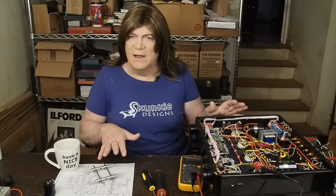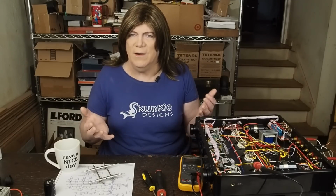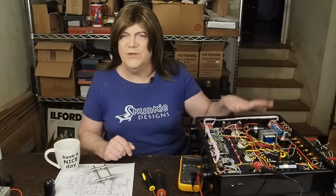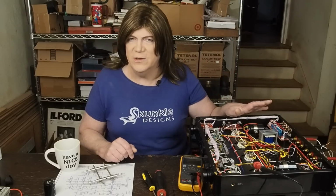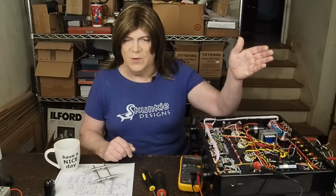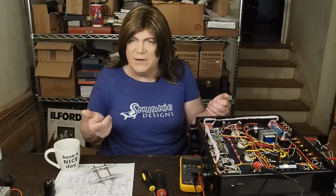And one of the things that disturbs me is I'm seeing a lot of the 110, 220 volt wiring that are just a parallel pair of wires, which you should never have AC wiring in a tube amp that's not a twisted pair. And we're going to be eliminating the 115, 230 volt switch because this amp's never going to be used in another country, and direct wiring up the power transformer to the IEC socket and then up to the switch using twisted pairs of solid gauge wire. Probably going to be doing some of that with the heater.